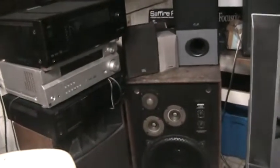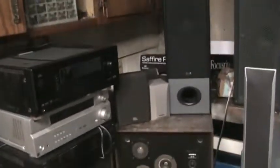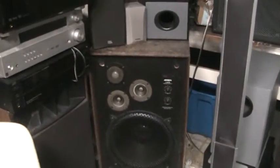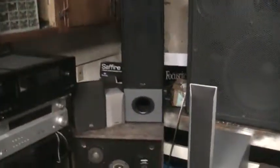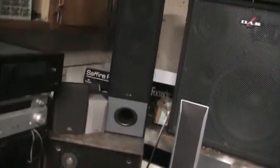There's a subwoofer back under the table because I didn't have room anywhere else — that Onkyo subwoofer is going up top instead; there's a little too much boom coming from the back. The JBL I always leave turned down. The Jensens I haven't touched — the silk dome tweeters are in beautiful shape, the woofers are in good shape with covers, but the mid-ranges I cannot find. I've bought four or five sets of compression drivers with horns and nothing fits — they're four-and-a-quarter inch instead of four.